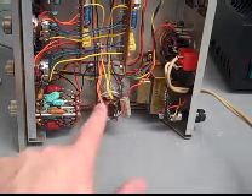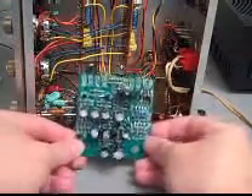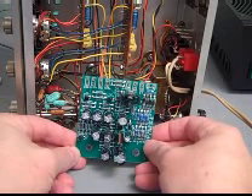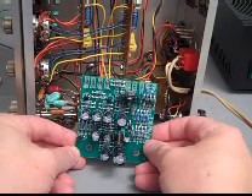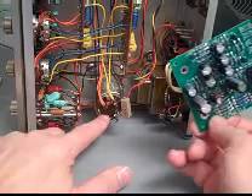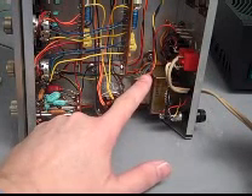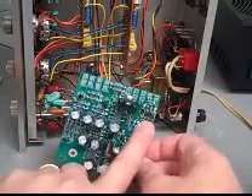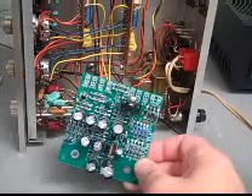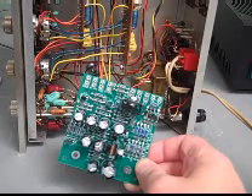The plug is out. Over here we've got the silver cap, and that's what we're going to be replacing with the UpdateMyDynaco PAT-4 power replacement. That electronic regulator provides really low noise, very steady voltage for both the high level stage and for the phono preamp. It's going to replace the three-section silver cap and a couple of resistors. We're also going to change the way the wires get routed from the transformer through the diodes, because this unit has the diodes on the board. The advantage there is we get a lot less loop area for the 60 Hz and the rectified 60 Hz, so we can definitely diminish the hum fields inside the PAT-4.